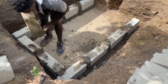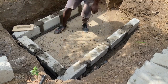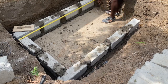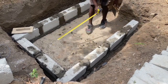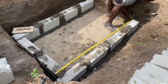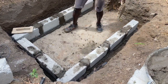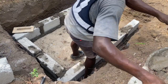The rectangular shape means the digester is about six feet on the length, two and a half to three feet wide, and two to two and a half feet deep. This ensures your bedding materials and filtration materials fit neatly and work as envisaged. The rectangular shape is preferred because these bio digesters have an outlet leading to the soak away or a drainage system, and a screening at the base to separate water from human waste.